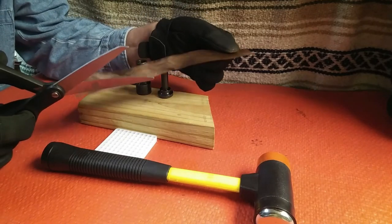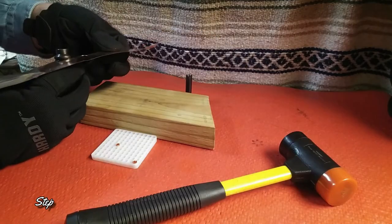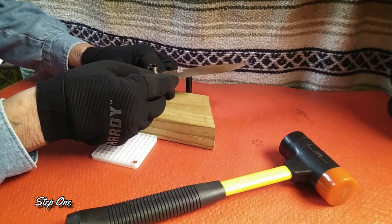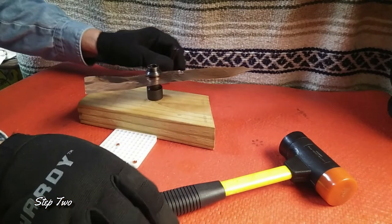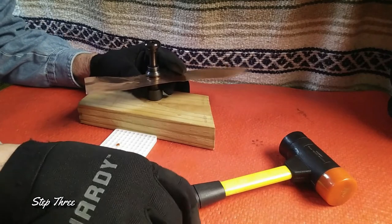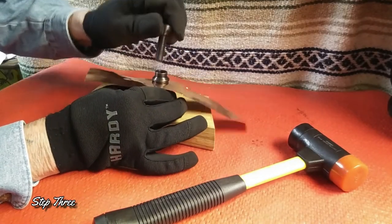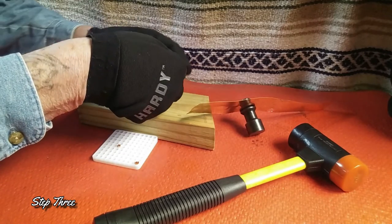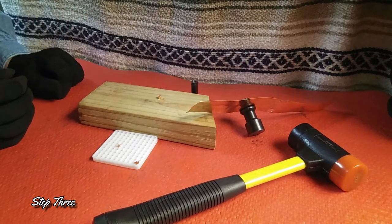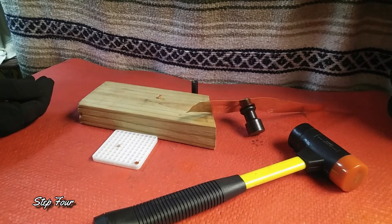So, here's what you need to do, which is essentially the same as using the soda can or other similar can. Insert the copper strip into the feeding slot of the number 11 percussion cap maker body. Insert the punch carefully into the guide hole. Place it on a solid base and tap the punch downward with a plastic hammer or a soft mallet. As before, use light taps to begin with until you get the feel required. Be sure to hold the strip squarely against the back of the slot. Once you feel the punch break through the copper, you can simply push the punch downward until it seats. Extract the punch, and invert it. The finished copper percussion cap shell will fall from the exit passage.